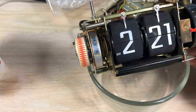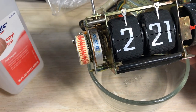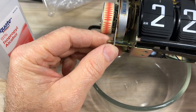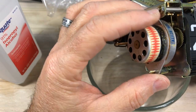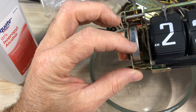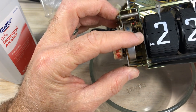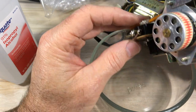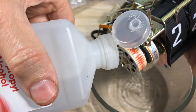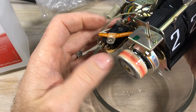The light is working and the clock's flipping just fine. We're going to go ahead and use alcohol — you want the highest percentage you can get, it's just better that way. I could take the motor off but I really don't want to mess with that — I think I can get good access the way it is. The gearbox is there with further gears I don't want to strip of all their oil. So I'm just flushing this out with alcohol and giving it a good spin to clean it out.